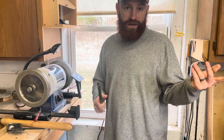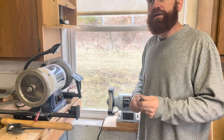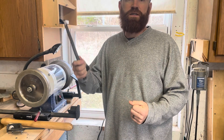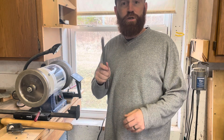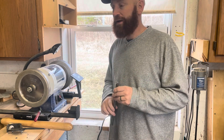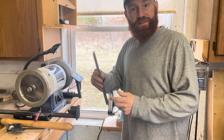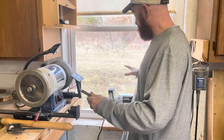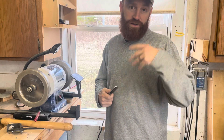A lot of people when they're beginners use carbide tools like the Easy Wood cutting tools or other carbide scrapers, and that's fine. But then they'll progress into traditional bowl gouges, detail gouges, skew chisels, and all that - and they will use dull tools, they really will think that they're sharp but they're not. What you'll find out is you have to go to the grinder frequently to touch your tools up - but you're not at the grinder very long, maybe 15 to 20 seconds, then you're back to turning.